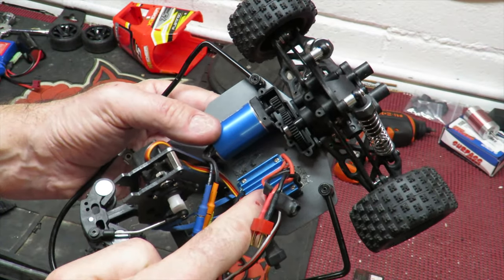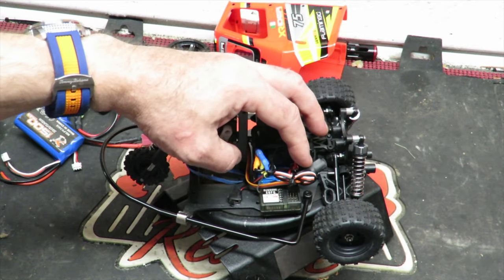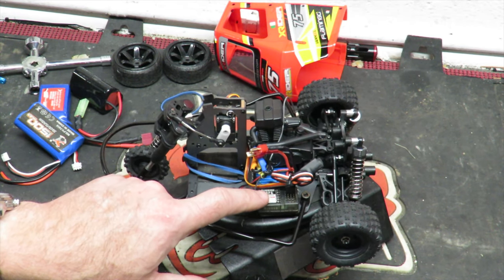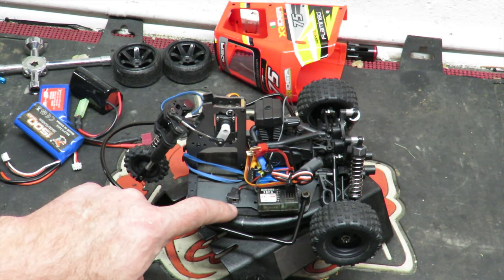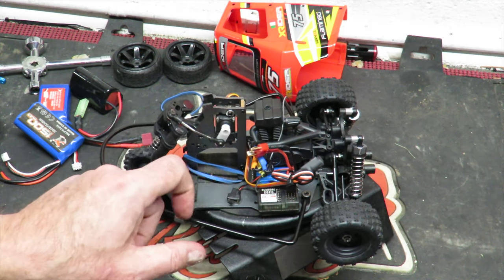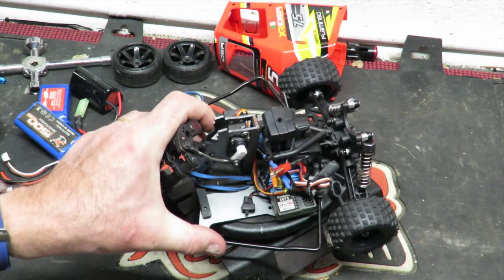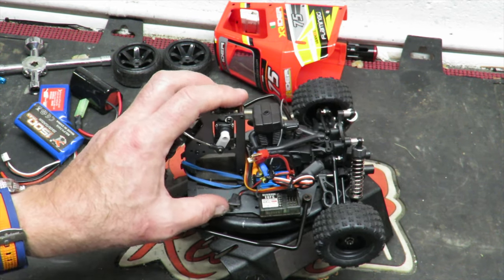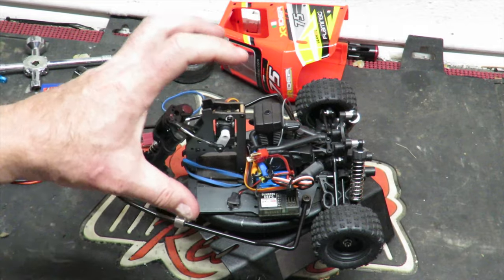I've got my new brushless motor and ESC mounted in there, so I just have to fit the engine cover back in place. I've tidied all the wiring with a couple of zip-ties. The ESC is mounted with double-sided tape. The Dumbo six-channel radio with gyro is mounted with double-sided tape — a little bit close to the edge but should be okay. The on-off switch is mounted slightly inwards using hot glue, so it doesn't catch the ground when the car leans over.